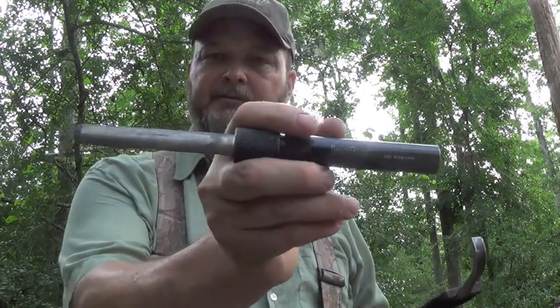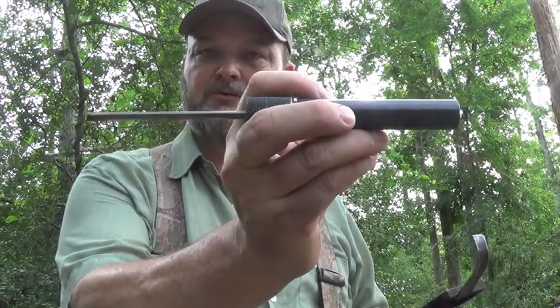I'm going to show you briefly how I sharpen it. I just use any diamond rod - any diamond rod would work - but I find that this Kershaw little diamond rod, it's kind of a flat oval, works great. Let me reposition the camera and I'll show you how I do that.